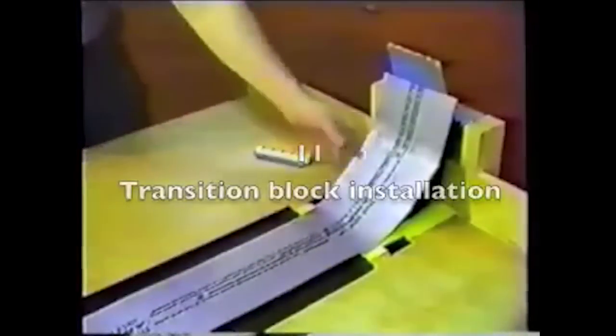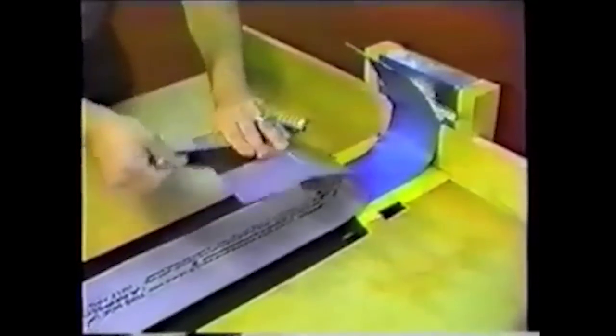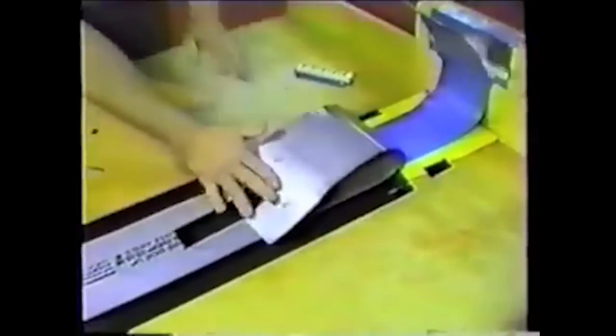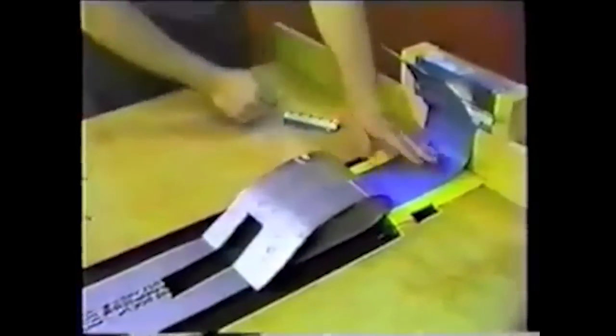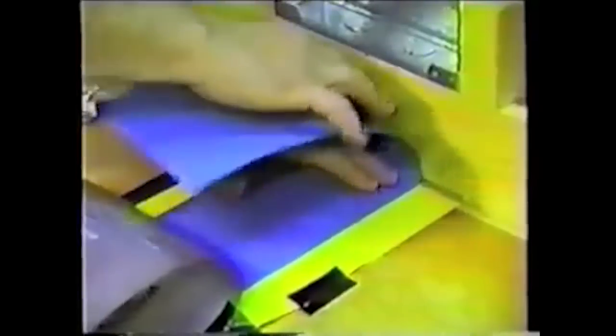To install the cable and top shield into the transition box, fold back the top shield and install a temporary strip of hold-down tape on the top shield to locate the top shield out of the way. Press down on the cable, forming a 90-degree angle for the cable to extend up the wall into the transition box, and route the cable inside the transition box into position to attach the cable to the transition block.